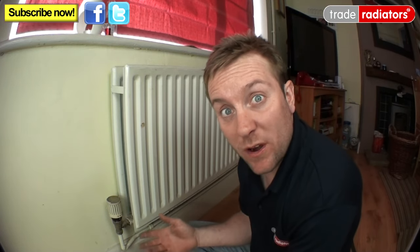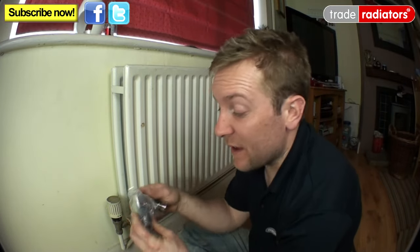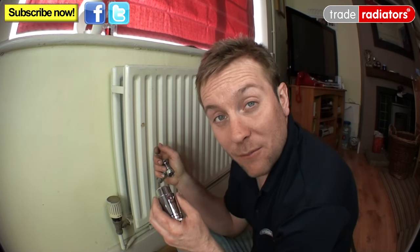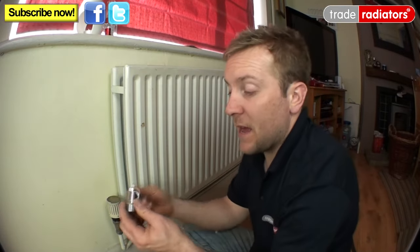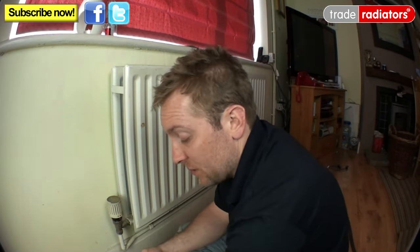Now we can have a look at the radiator valve we're going to change. We're going to change this old horrible TRV for a nice new one, and this also works if you've got two lock shields and want to change one of them. This is one of the Elegance range TRVs — got a nice chrome head and they've got a lot more selectors for the different temperatures. When you get your TRV, make sure you look at the little bit of paper that comes with it, because these numbers don't correlate to the temperature of the radiator but to the temperature in the room. That's a common misconception about thermostatic radiator valves.